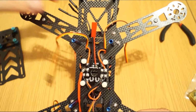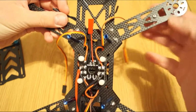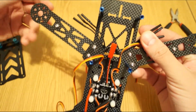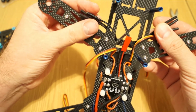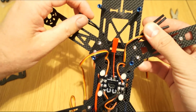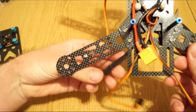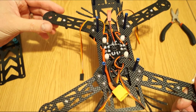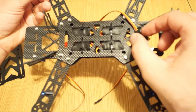Okay, everything is prepared for the electrical connection. These are the wires that will go to the motors on each side. Of course, I don't have the tiny bullet connectors, and I also don't need extra connectors that vibrate at high resonance frequency. So I will probably remove this and solder it directly for each of the four motors. Then in the next video we'll see how we set up and connect the CC3D and how we program it, so we get towards the finish of this build video series.